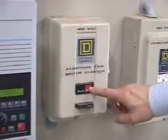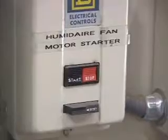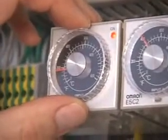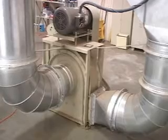The purpose of this relay is to immediately turn off the Humidaire unit when the moist air fan is turned off. Although the Humidaire unit is equipped with airflow sensors and internal heat sensors to prevent severe damage, this interlock is the best insurance against an attempt to operate the unit without airflow.